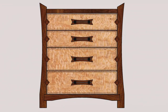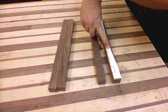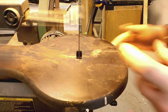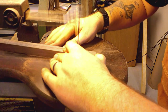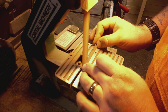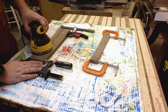I'll start by cutting all the curves. The legs, drawer pulls, and bottom cross members all need to have curves cut into them. I like to use templates for layout as this ensures consistency. My scroll saw works well for the cuts and I have mine set up at a comfortable height. Because the pencil lines can be tough to see on walnut, I added a task light. I use my one inch belt sander to pare the curves to the layout line. With the rough sanding done, I clamp the pieces together and sand in with a random orbit sander.